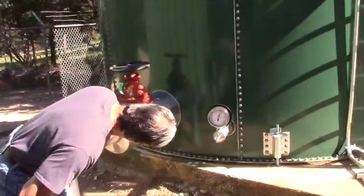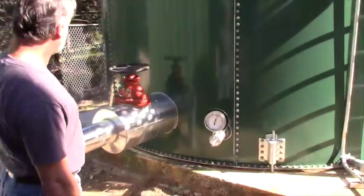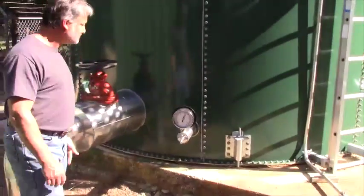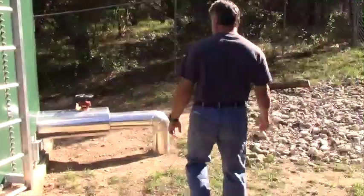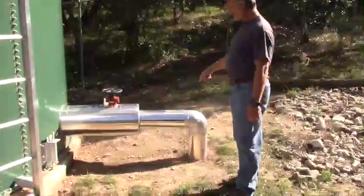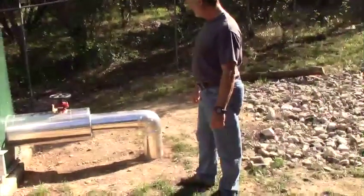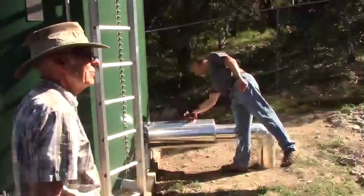The red line corresponds to the height of the tank — about 24 feet. There's also a block valve to isolate the system. This valve is the inbound line from the water wells — water goes into both tanks at the same time unless you choose to isolate one from the other.